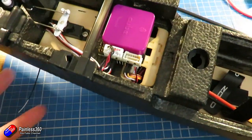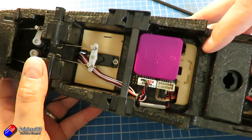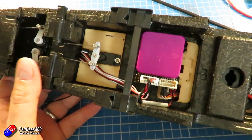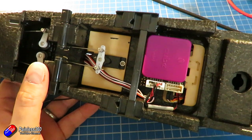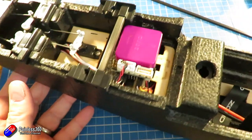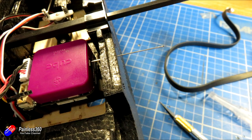Turning the model over, here is the Pixhawk cube. Be aware that there is an arrow on the cube that has to be pointing forward. If it isn't pointing forward, you can configure it in Mission Planner, but my recommendation is to always mount it in the default position — the top of the cube upright with the arrow facing towards the nose of the aircraft. I've also cut a little hole in the side so I can get a USB cable in and out easily.